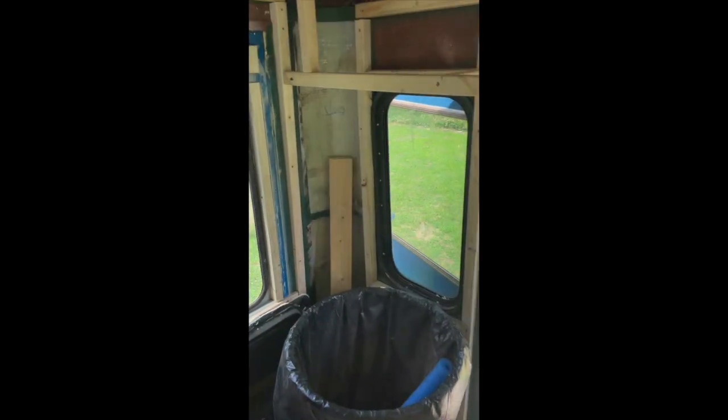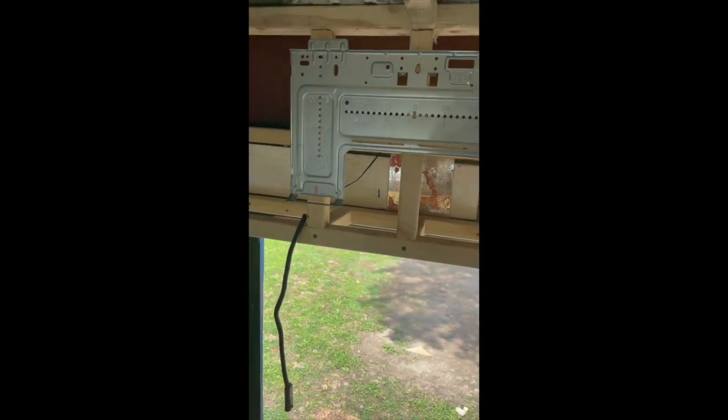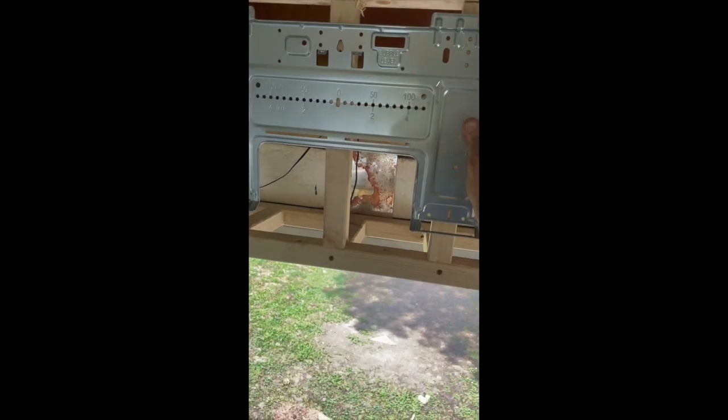Today's project — we're building a bulkhead here that sits out from the wall. We're reinforcing it from the back side as well, so that this backing plate for the mini-split can get hung. When we actually went and unpacked it, apparently we bought the 12,000 BTU unit — we thought we'd bought the 18,000. So we had made a bunch of modifications to our solar and electrical system to accommodate for it, which we don't actually need. Win-win.